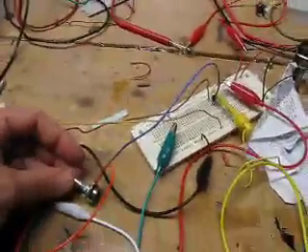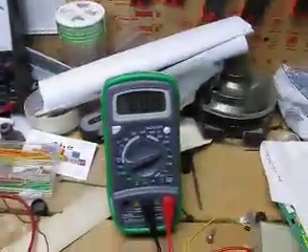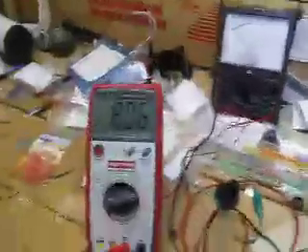We've reconfigured our red multimeter to read the voltage at the collector and then the voltage at the base. We've turned the emitter loading back down to zero, and we currently have a maximum of one meg on the base pot, so we have eight microamps worth of base current.